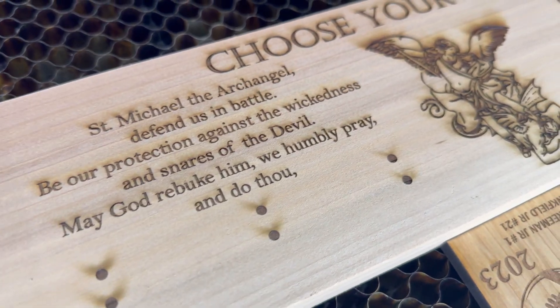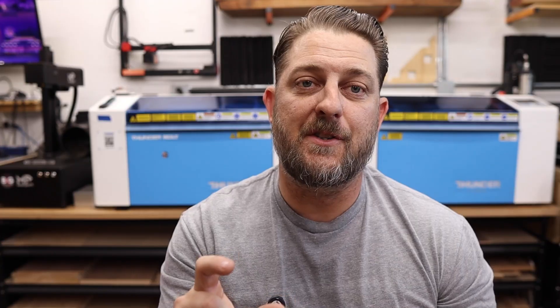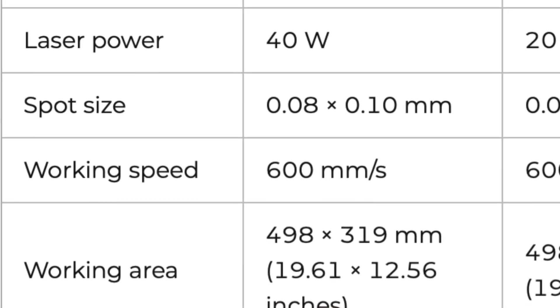The 40-watt module with the Smart Air Assist cut through our 6mm MDF really well — I was very happy with the cutting overall. What got me was the engraving detail. For larger things it engraved beautifully, but we routinely engraved logos about 1.5 to 2 inches in diameter and small text around 10-point size. The 40-watt module struggled with this level of detail, and understandably so due to its spot size. For example, we weren't able to engrave lowercase i's without the vertical line and the dot merging together into one vertical line. Same type of issues occurred with small text on logos — the spot size was just too big.